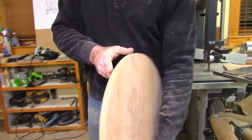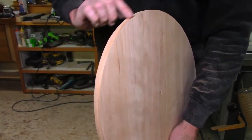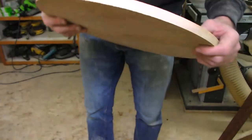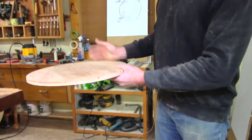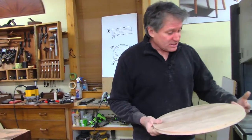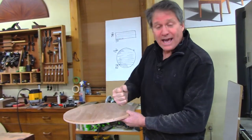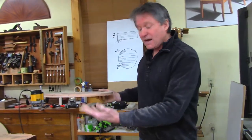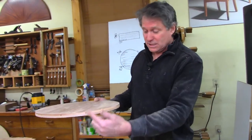Okay, so you can see what I first routed is that smooth inner circle, and then I bandsawed, staying off that line. You definitely don't want to hit that or mess up your pretty circle. Now, I could have done a very light scribe around the first time, very light, then bandsawed the same way, and then took the same plunge and go all the way, so now you're just taking a skim cut around the circle. You'd have to have it on a sacrificial piece of MDF or something, because your bit is going to overextend the workpiece and skim around.